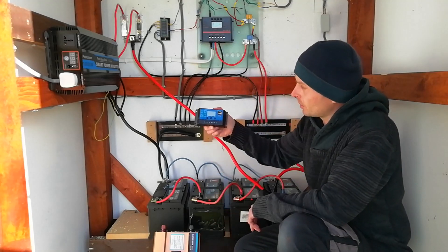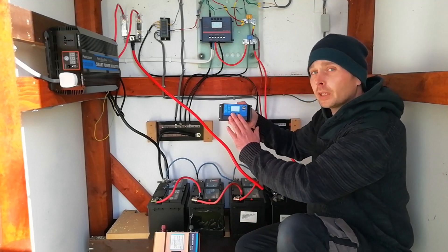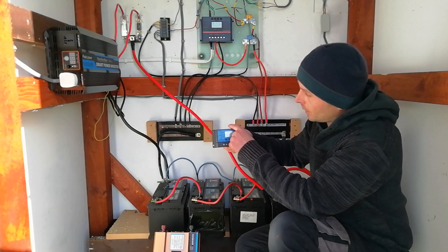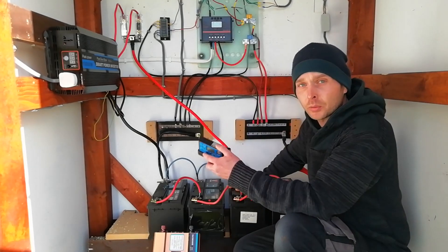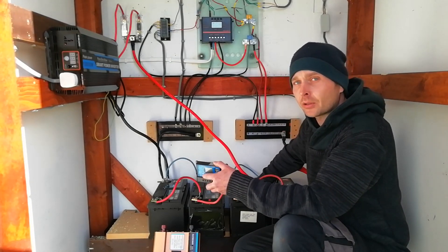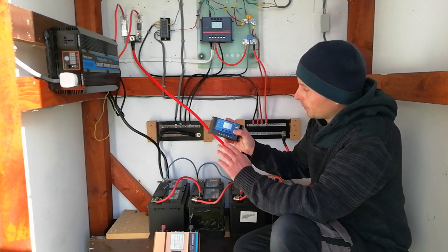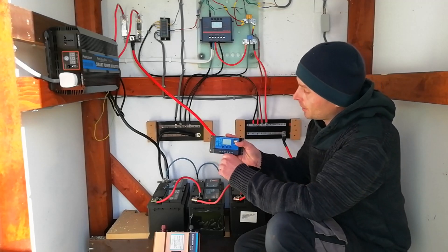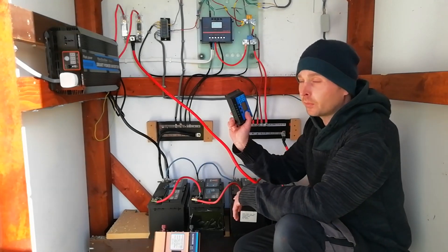We started off with a smaller solar control unit because we just had three panels to begin with, and now we've got eight. This little unit worked really well until eventually it failed — I noticed the voltage started creeping way up. It didn't regulate to 14.4 volts anymore, which is what your 12-volt system needs. That's what your car charges at too — when your alternator is running, it's between 14 and 15 volts. This unit cost about 10 quid on eBay years ago, but eventually it failed and was creeping up to 18 volts. Again I was just in the right place at the right time to disconnect the system before it went on fire.